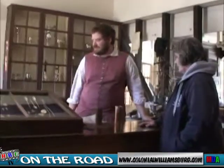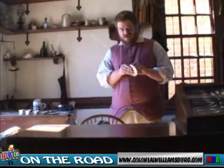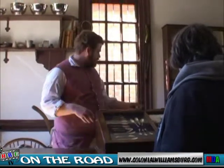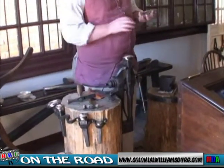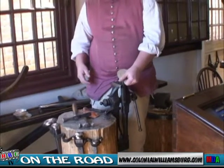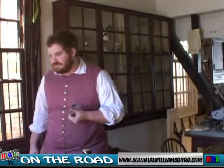Now the other way of making things out of silver or other metals is by taking a flat sheet of silver like this, a flat round sheet of silver generally, and bringing that over here to stakes. So we have these things called stakes, which are made of polished steel. You're going to place those inside a device, and then take your flat sheet of silver, draw circles on it with a compass, and then brace it up against these, and you're going to hammer and turn. And as you hammer and turn, it's going to start rising up. The walls are going to start rising up like that little progression there.